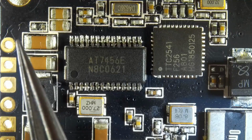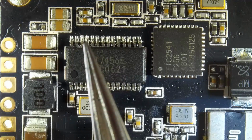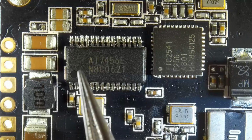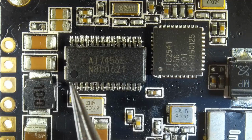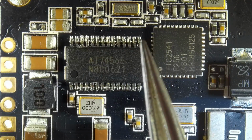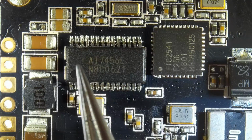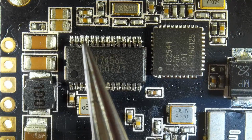The next step would be to do the same exact thing we did with the oscilloscope on the pad, but on the pin. It's not pin number 3 actually, it's pin number 26. Starting from here that would be 1, and this is pins 1 through 14, and then it goes up here 15 through 28. So just find the little dot, go up, count 1, 2, 3, so it's that third one right there. That's the video out. This is where you would want to touch the oscilloscope.